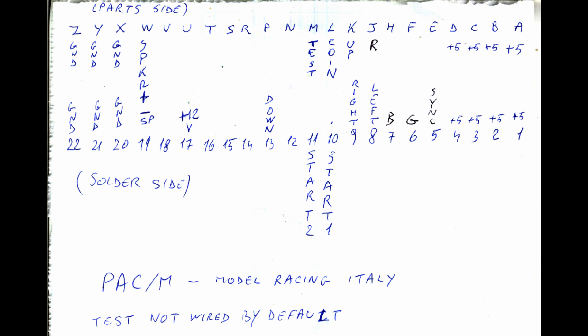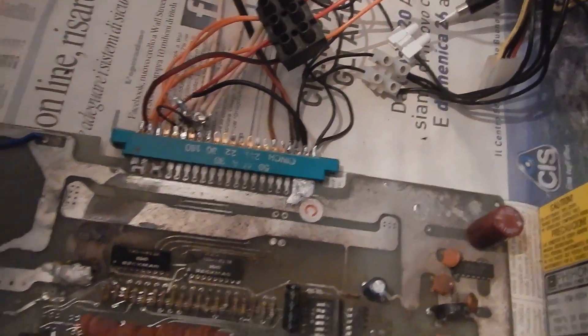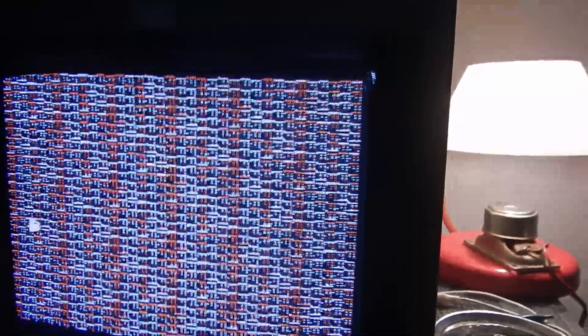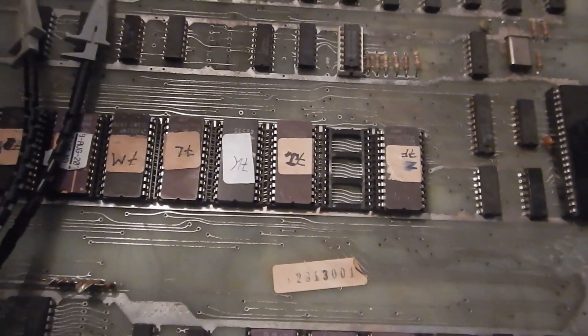As a last step, I had to work out the pin-out of the edge connector by inspection and comparison with the original Pac-Man schematic. The test switch input was originally not wired to the edge connector, so I wired it to an unused pad. I wired the edge connector with power supply, audio, and video only for the moment. Let's power on and see what happens. We get a garbage screen, but at least the video sync looks good. I'm trying removing one EPROM at a time - with old sockets it's always something we can try. The game is trying to boot, then it gets the watchdog reset and loops again. After cleaning all sockets and reseating all EPROMs, it seems the game starts fine.